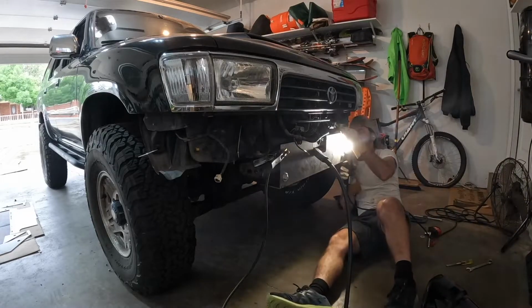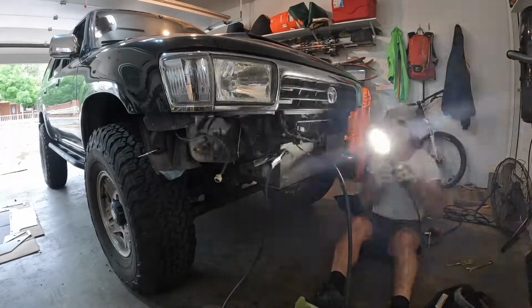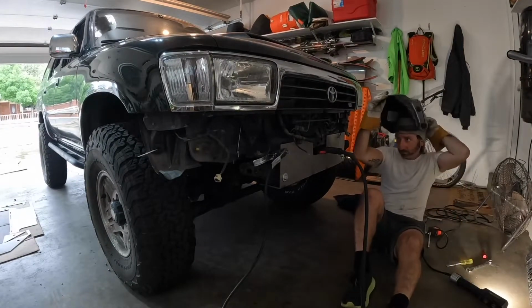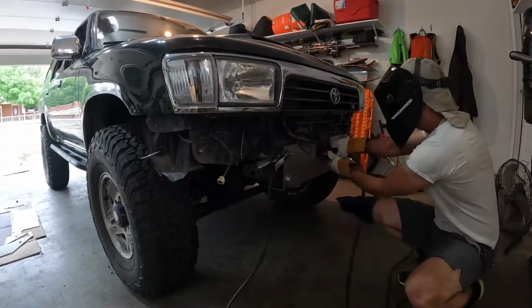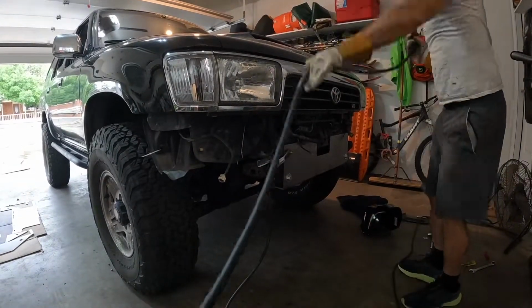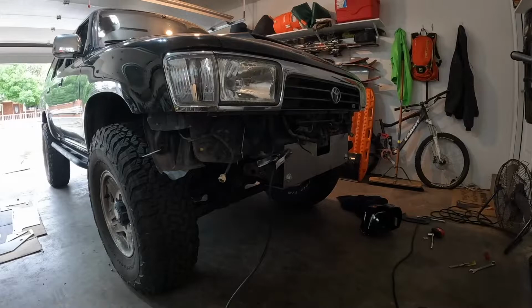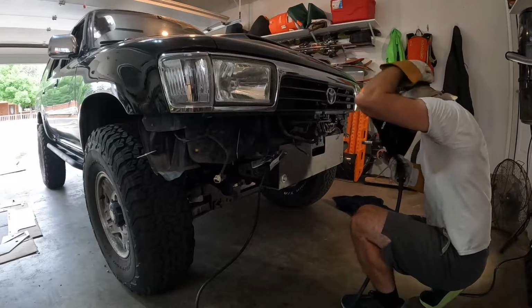Is it pretty? Absolutely not. Did it work? Of course. So again, definitely a big struggle. You see me trying to get all these lined up. I did weld these with the bolts going through. I didn't really have a choice. It wasn't ideal. I'm always afraid of having the thread stretch or something like that. But in the end, it was much easier. Obviously, when I would get the MIG gun in there, it would start to move the nuts, so I definitely had to bolt them through. They're quick tacks, so I wasn't too worried. But yeah, was able to get this tacked in, and then once we get it on the bench, we're able to do all the finish welding.